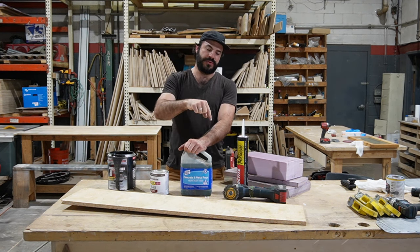And then side to side, I'm going to measure from this edge to the side of the bus here. And I'm going to record those measurements on here, and then I'm not going to cut the opening yet on this top last layer of plywood. I'm actually going to glue the plywood down, and then I'm going to use those measurements to locate this back where I want it. And once I have this back where it should go, I'm going to trace around it on the new sheet of plywood. And then I'm going to set the depth on the bottom of my circular saw to 3/4 inch, and I'm going to plunge cut the opening out.